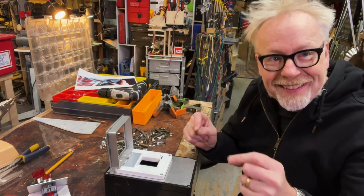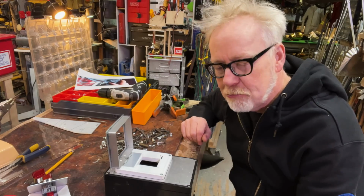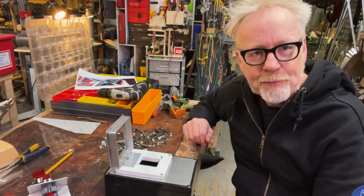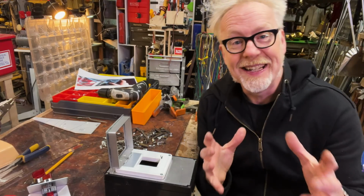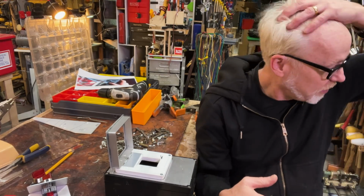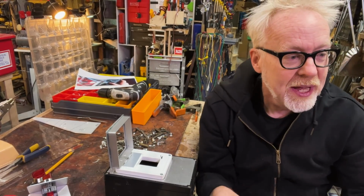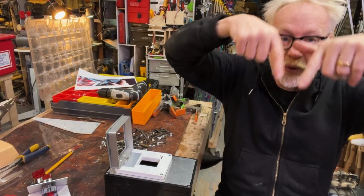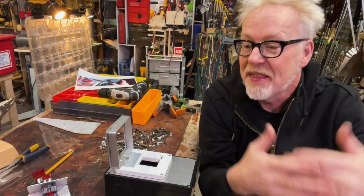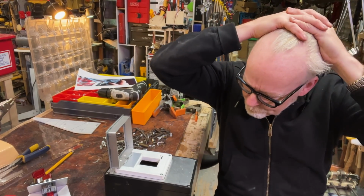Little springs in little places is a very, very tough bit of mechanical work. Spring return and stuff like that has always been hard. In order to do mold making, you have to be able to think upside down and backwards. You have to think of the inverse of the object you're casting, which will be the mold you're casting into. And then you need to think about where that will lead to air bubbles when you're pouring resin into it. So you can add vents and choose an orientation that minimizes cleanup, right? The whole orientation is like seeing backwards in time.